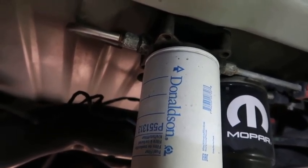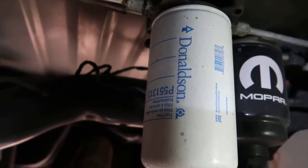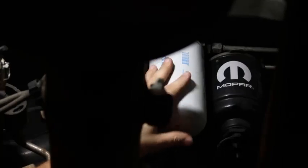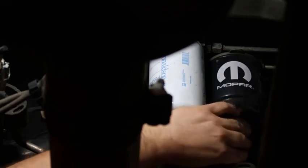They make them for Ford and Chevrolet diesel trucks too, and they do a real good job. I just wanted to let y'all see what kind of setup I have on my fuel system. Now I'm fixing to take off this fuel water separator on my 2017 Ram 3500 diesel — this is my auxiliary filter from the CAT system. First thing I'm gonna do is open the drain valve right here on the fuel water separator and drain the fuel out into a bottle.